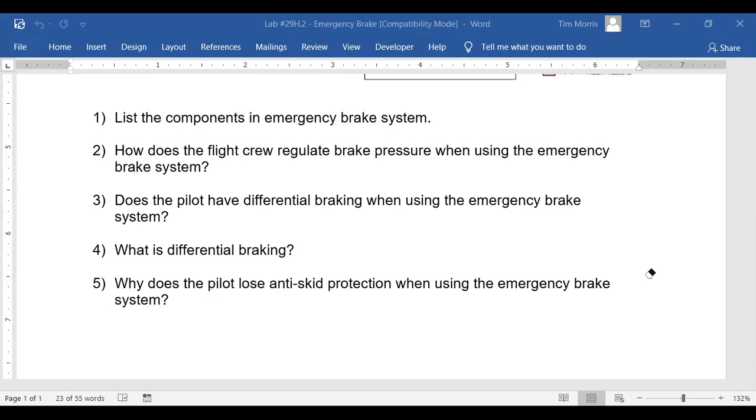So if I'm taxiing the airplane, I step on the right brake and I don't step on the left, I can make the airplane turn to the right. I can steer the airplane with the brakes. Now, my airplane, you can do that. That little two-seat airplane that I fly in, the KISS, it has differential braking. So I can steer the airplane with the brakes. And the nose wheel is not connected to the rudder pedals. That's on a swivel. But there's some airplanes, like a tail dragger. You take those airplanes, they fly in like Flying Wild Alaska. They steer them with the brakes. So that's differential braking. If I hit the right brake, makes the airplane want to turn right. If I hit the left brake, makes the airplane want to turn left.